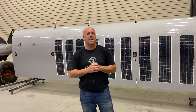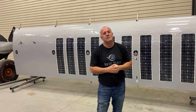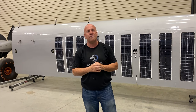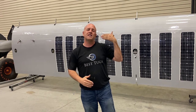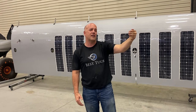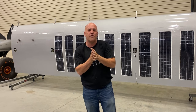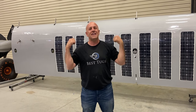And then if I happen to have a long cross country, maybe I'm crossing the ocean, I do want to travel some long places with Scrappy. If I lost dual alternators or had a battery failure of the primary system for the aircraft, with a quick flip of a switch, I have complete redundancy off solar. I could continue all 10 hours of range Scrappy has on board in fuel with everything powered up into the night. If I had to finish a leg overnight before I could get to an airport, the solar would keep me topped off until that sun goes down, and then I can run for hours and hours and literally outrun my fuel tanks on my spare batteries in the wings of Scrappy.